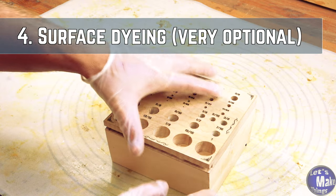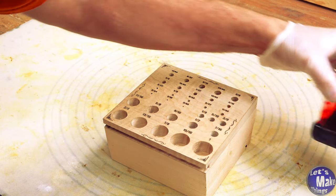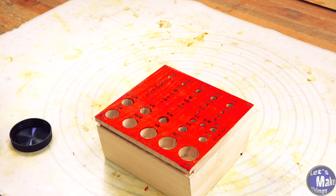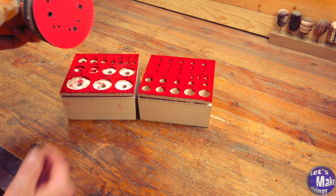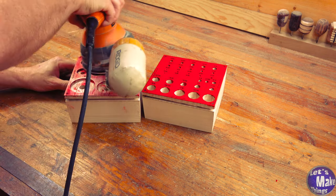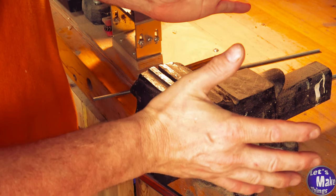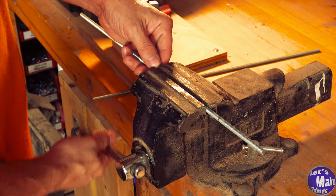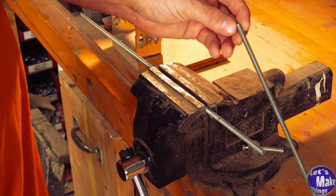Before I sanded everything up and attached the bars, I decided to add a dye to the top. I'm using curly maple here so I want to show it off a little — I'm going to use a little bit of red dye. I set this aside and let it dry, added a second coat in the middle, and now it's dry. I'll use 100 grit sandpaper to clean it all up. You'll take the column of your drill press, add both side pieces, and that gives you the length of the bolt you need — then go about a half inch over that. You'll probably need a 36 inch quarter inch rod. I cut my rod in half and cut each section from that, so I keep one end with the threading intact.